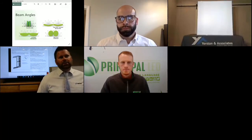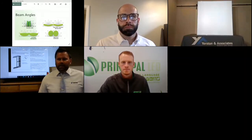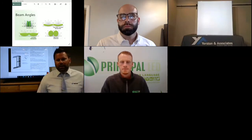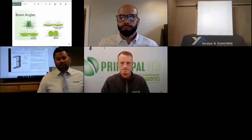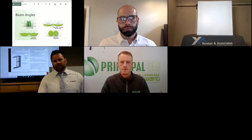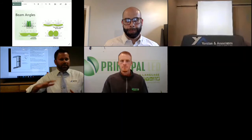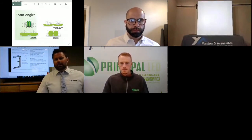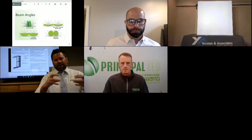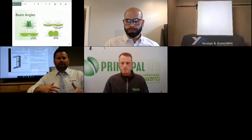So with a lot of these retrofits, that 2107 profile that Joe just mentioned, some of these are so big that you're not going to try to hinge it open anyway, or they're so deep that you have a little service door, or because the LEDs are lasting so long, you just need a little spot where your power supply is sitting to be able to change that out. You're never going to really have to get in there and service the LEDs. And so rather than having all the weight that could come with the supports and the grid pattern, if we're just doing a simple retro, you can have that support for a double-sided application connect laterally through the cabinet. So now it's pushing on one another rather than having that grid pattern.